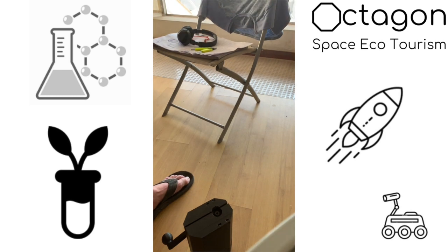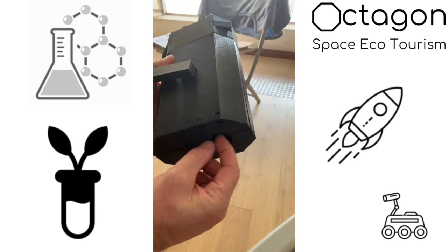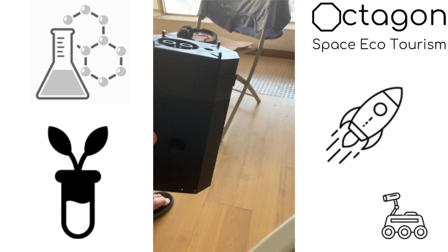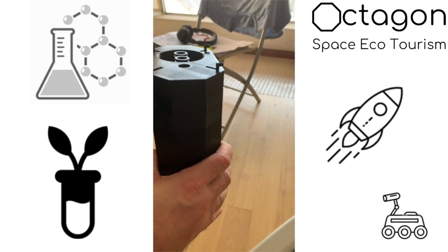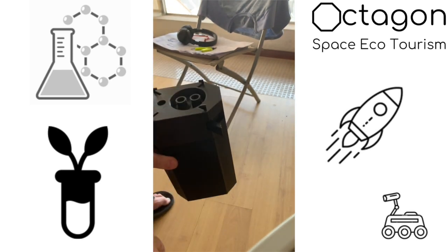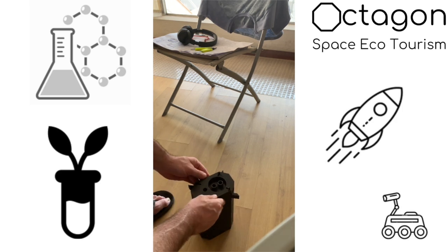So now that we've got that out, we can continue the disassembly of this pump, which basically has to do with these two pieces here coming apart so we can see the internal mechanism. Before I can do that, I need to take this up because that's holding these two things together. Very similar to the bottom pieces, I take the four little latches, open them up so that these things here are parallel, and then I can just lift it up.